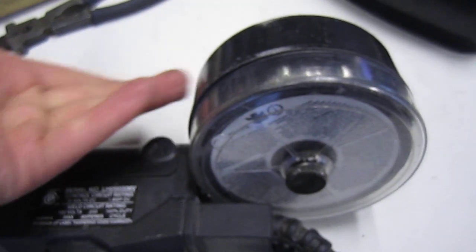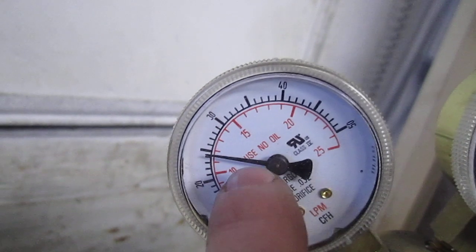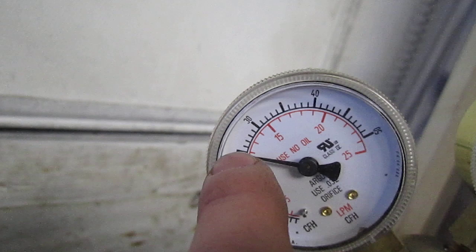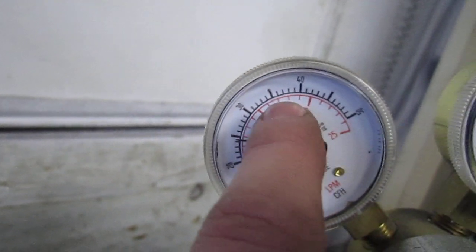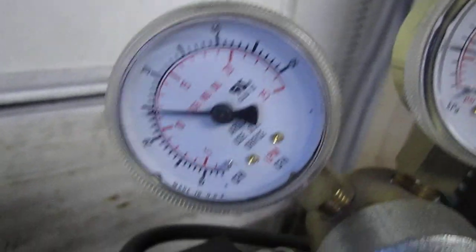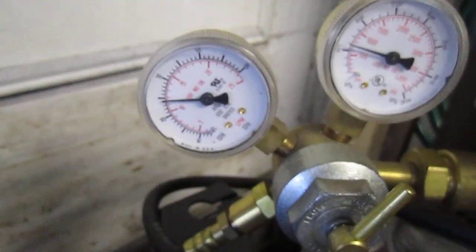If you're left-handed, turn the wire the other way and get that curl going that direction. Next is your gas setup. Inside a shop you can probably get away with 20 CFH. I run about 20 to 25, and if it's a little windy I'll go up to about 35. Any more than 35 and you're gonna pull in atmospheric air and get contamination in your weld. If it's too windy, you just can't weld aluminum outside — so get everything set up right and you'll have fun.